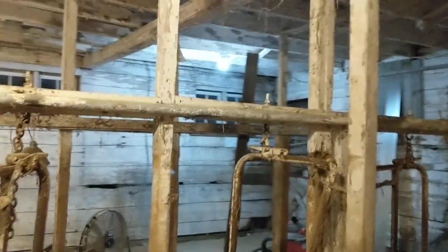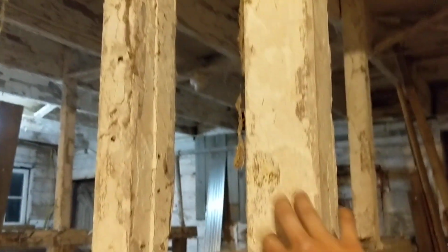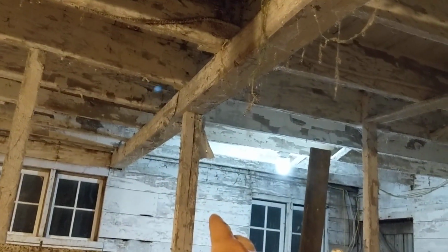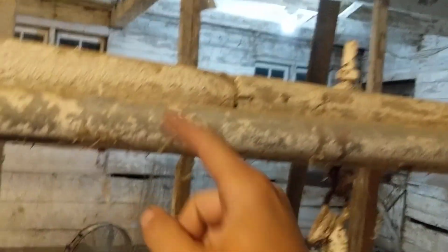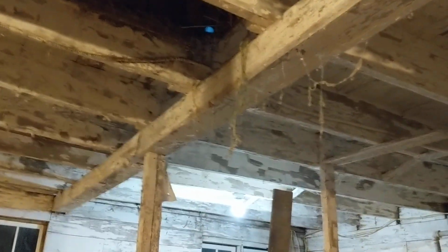And then down here, we're going to have 2 more 6x6s. So this is a 4x4 that's supporting a 6-inch beam with this ridiculous sheet metal nonsense. I don't get that. This will be deleted and replaced with a 6x6. And then actually the equivalent of this on the other side isn't there. You can see that sheet metal is ripped out. There used to be a beam there. It's not there anymore. And when you look at these ridiculous nailed together 2x4s, they're not straight, but they are definitely taking load. That's not a good situation, so we're going to fix that.